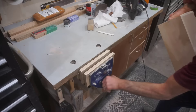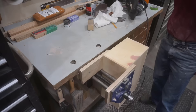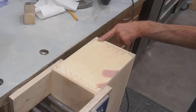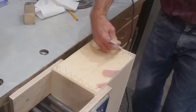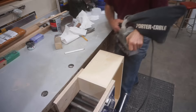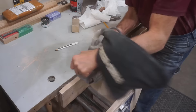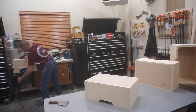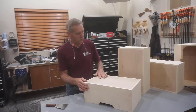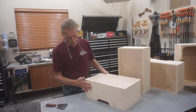Sanding the ends of these boxes is similar to sanding the top — I use a pencil mark to draw squiggles to show how much the side is sticking past the end, which guides me to sand off just the right amount. Where the face and the edge are perfectly flush, the squiggle mark goes across with no stuttering. That quick bit of sanding leaves these repairs looking just like they should: edges are crisp and square, flat and smooth — exactly the right condition of the substrate before laminating. Once the pencil marks are gone, I know I'm done.